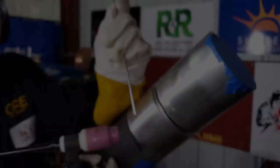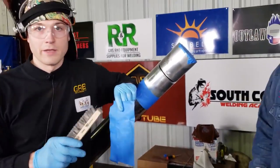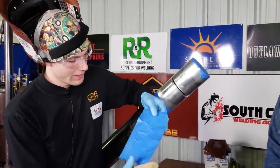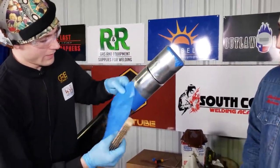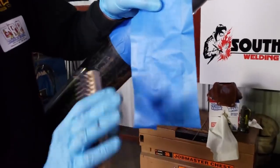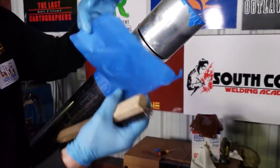Nice, Travis. All right, now this is another thing that Jerry at GRB College of Welding had taught me, for welding stainless, nickel alloys, duplex, super duplex, titanium, aluminum, particularly aluminum. I have the tape right here. What I have is three layers of one side of the tape, and then two layers of the backside. So the tape has been reversed and stuck to the backside. Essentially, the non-sticky side of the tape is going to go against the weld zone.